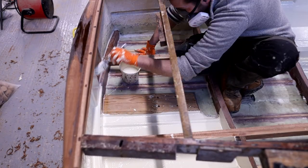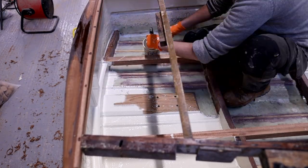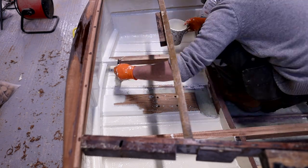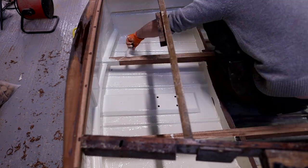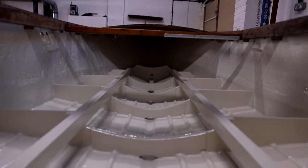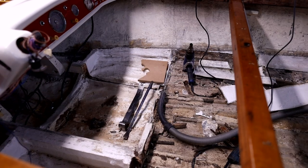I used this paint on the inside of Missile many years ago and it's pretty much my go-to bilge paint. It's a pure epoxy top coat, it's got a little bit of sheen to it, not particularly glossy, but it's highly resistant to water, oil, petrol — pretty much anything you're potentially going to have swimming around in the bilges of these old boats. It's a bit of a forgiving, slop-it-on kind of paint where protection is your primary concern.